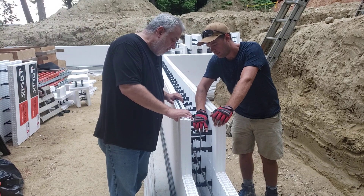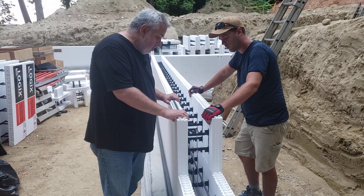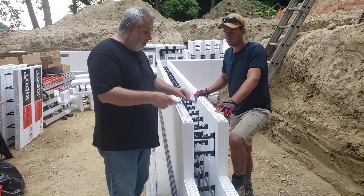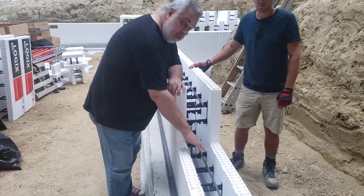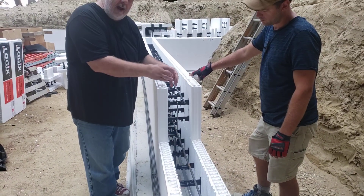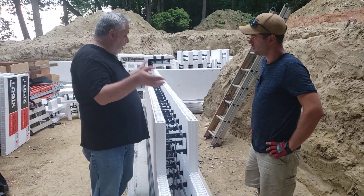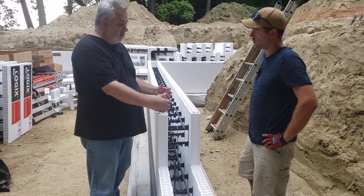On the outside we have room for a number five bar, so we typically use those. In the middle there's a number four bar that can run all the way, and then two holes for number three. We're talking reinforcing bar, for our non-construction viewers. You can see down here they already have some of them placed, and we also have the vertical leg that comes out of the footing. The concrete will go down there, grab that, and that keeps the horizontal displacement of the wall sturdy. These horizontal bars will get tied to some vertical bars in here as well, so we basically have this steel cage happening inside.